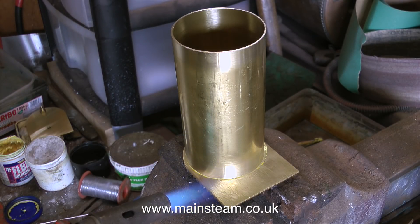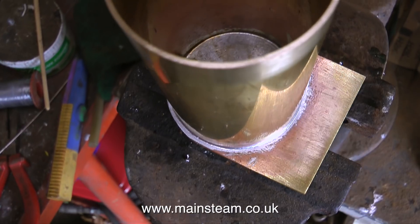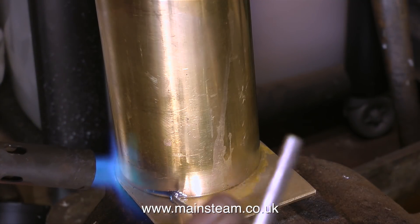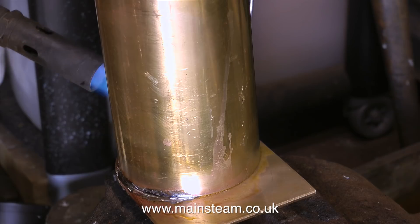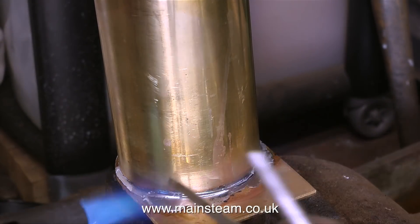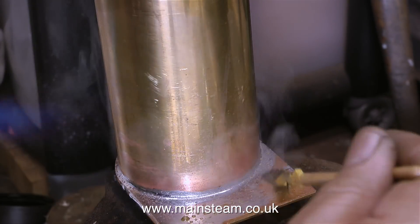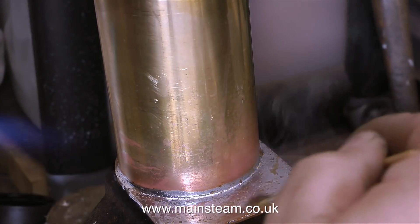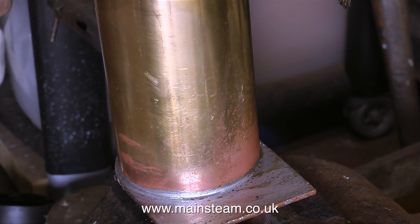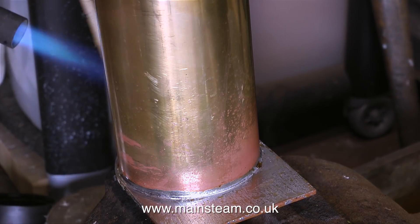I did actually video the complete soldering sequence, but most of the video wasn't really watchable because my hand and arm got in the way. But here is a shot down inside the tube once it had been soldered. When this assembly had cooled sufficiently so I could handle it, I turned it over and accurately positioned it on the other side plate, and here I'm soldering it in place. This time I do have video of the soldering process because it was much easier to film on the outside. In this clip I'm just demonstrating the use of flux — when I brush the flux on the metal, as you can see the solder flows wherever the flux is. When making a soft soldered component like this, I clean up the solder by dipping the brush into some water and cleaning off all the burnt residue before I let it cool.